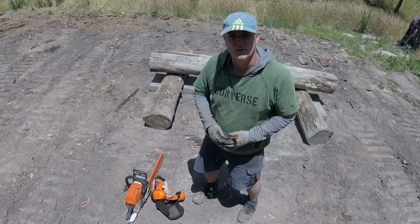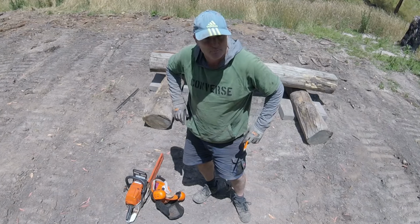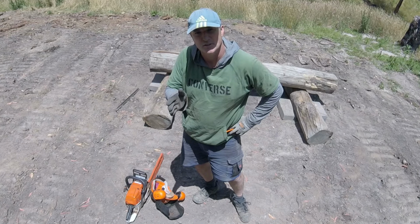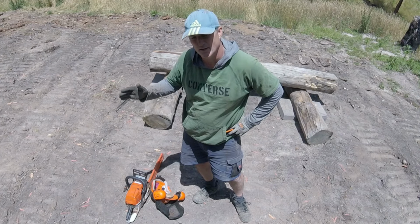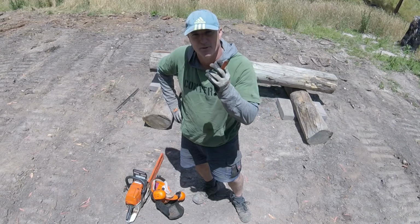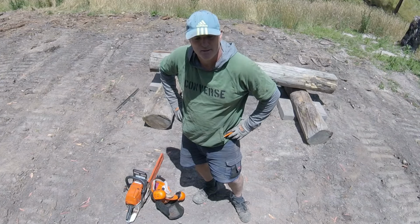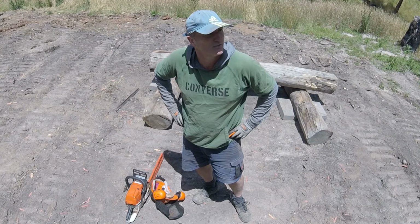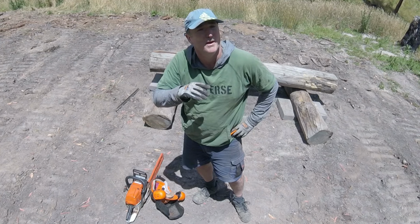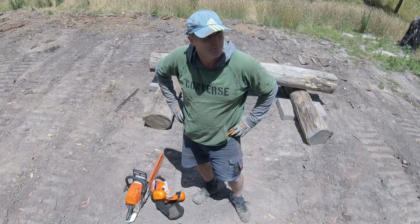Right, we'll get the chainsaw going, put a series of parallel cuts into the beam, shallow at the edge of the log and going deeper and deeper, and then back out to shallow again, and hopefully we can then chip that wood out, and we'll try and make these two logs fit together. As you can tell, things are warming up now with the flies that are buzzing around.